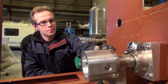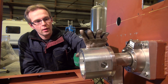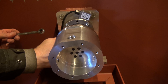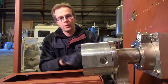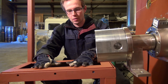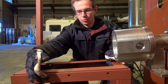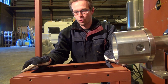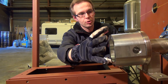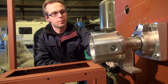This is the front end of the test stand. Here we have a load cell and onto that the LOX dome is fitted. Currently this is the BPM2 LOX dome. The engine will be mounted out here, sitting on this sleigh system. Inside here we'll have some ball bearings so this can drive back and forth a tiny bit, such that the engine will push up onto the load cell and we'll measure the force from the engine that way.